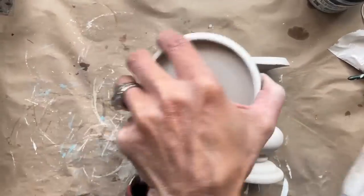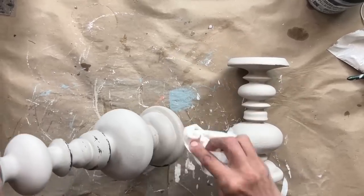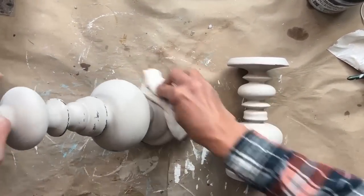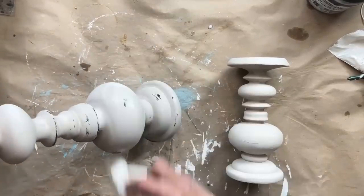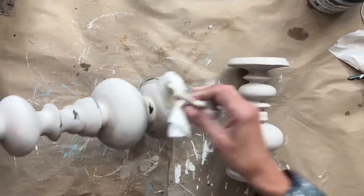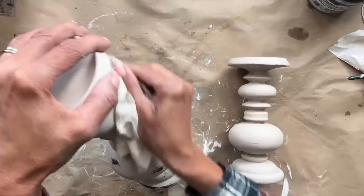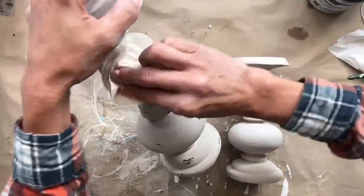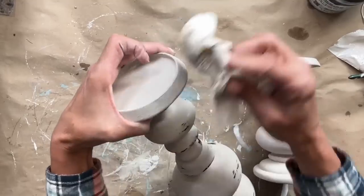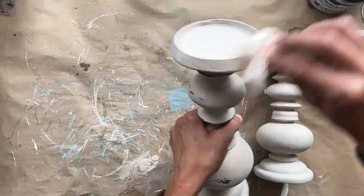I love wet distressing the DIY paint. You can use sandpaper as well, but by wet distressing you are alleviating a lot of dust and you have a little bit more control over the amount of distressing you're putting on. Sometimes when you're using sandpaper, the black can actually be distressed as well. So I wanted the black to show through, and I'm just randomly taking my wet rag and going over all of the raised areas. This has been a very popular look in my booths, so the candlesticks typically sell pretty quick.